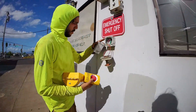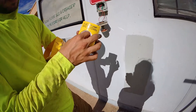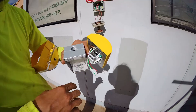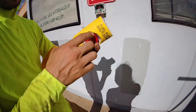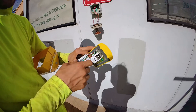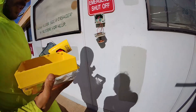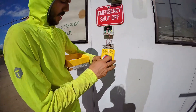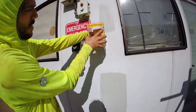We're gonna have to replace this whole thing — this will have to come off the lock nut. This goes on top. See this little press button — it has these little contacts on them for normally closed stuff. We will put those in and do that together. These are for lights on this and we don't have the circuit for that, so these will just be capped off. Then we're gonna focus on getting these wired in first and everything turned back on, and after that we can work on putting these on the outside.